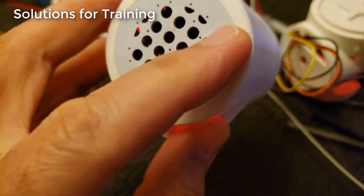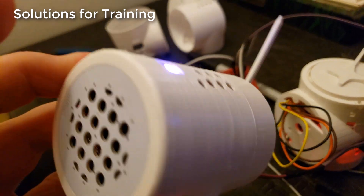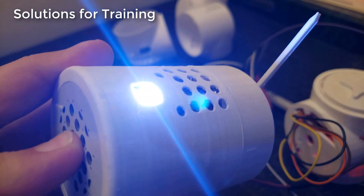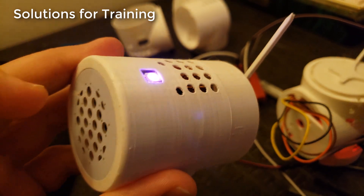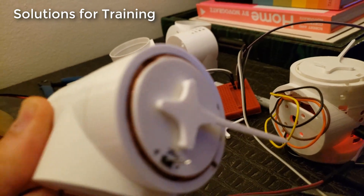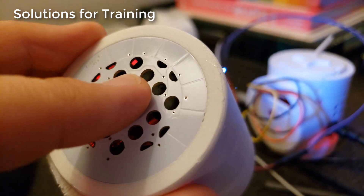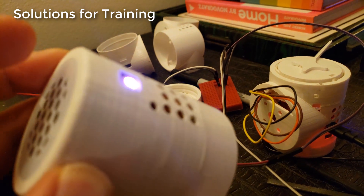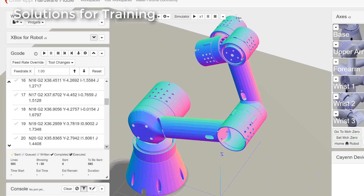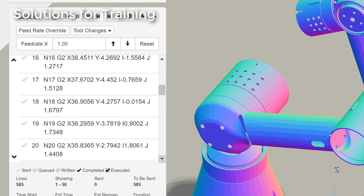For training the robot, the best approach is to physically move it into position using the touch dials on each actuator to set start spots and waypoints. Once it's in the preferred position, you long-press the center button on the touch dial to record that waypoint as G-code, then play back the G-code from the touch dials or from the Chili Pepper workspace running the robot arm.